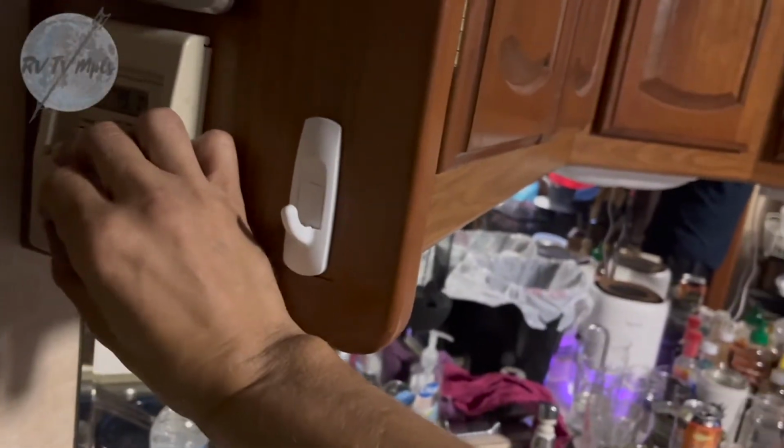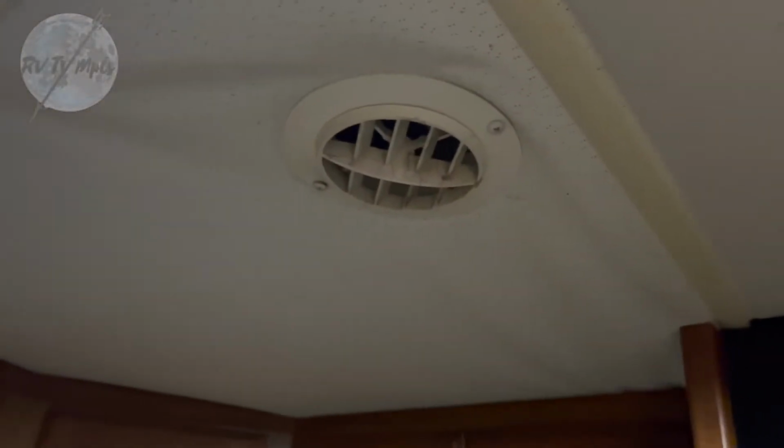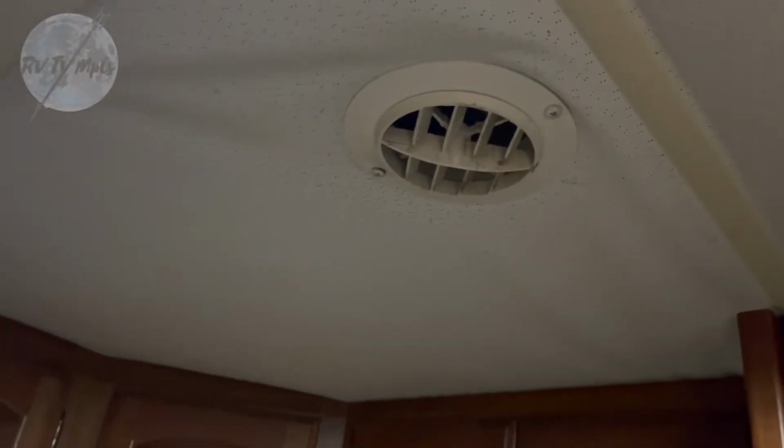I got the bilge fan hooked up and it is blowing air out of all these vents at a pretty good clip. And I'm able to switch it off. It's a little bit louder than, you know, it's a bilge pump. It's not bad. I got to see if this thing gets hot. I don't think it will. It's only pulling 6 amps max current. So yeah, one part down. It's all wired. Now I just got to get everything else done.